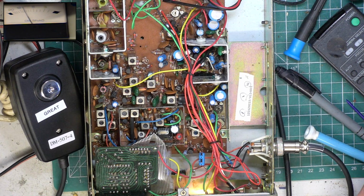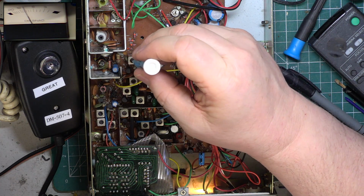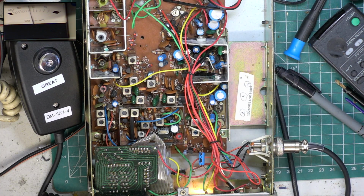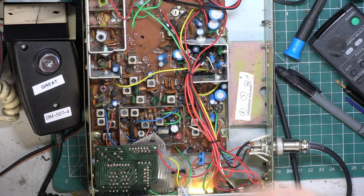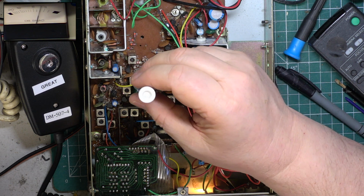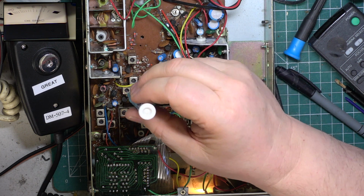Okay, so now we'll go to the front end. These sound more like AM, and the meter on these, the S meters, it actually is AM. No, sorry, not the meter, the squelch. The squelch is AM. We'll go to 4 dB on the meter, and then we'll see if we can improve it on there. As ever, we'll try not to saturate the receiver. So that's definitely best. May have scored a fraction there.